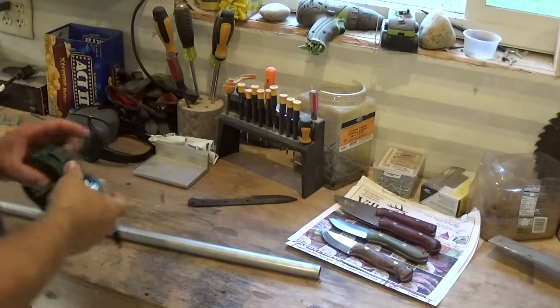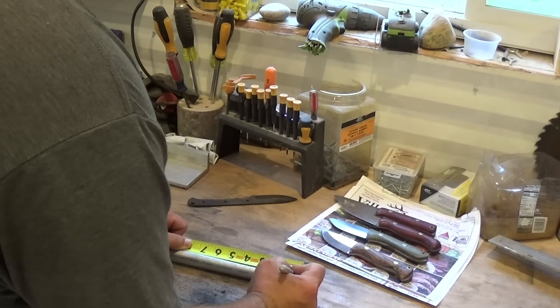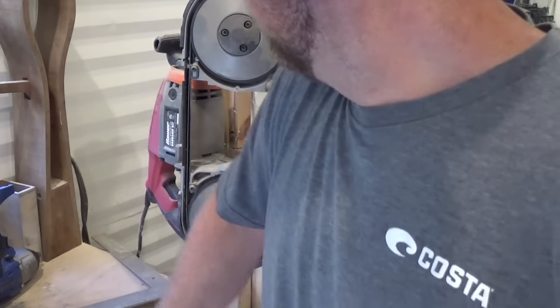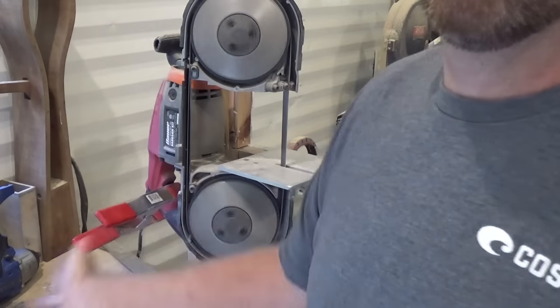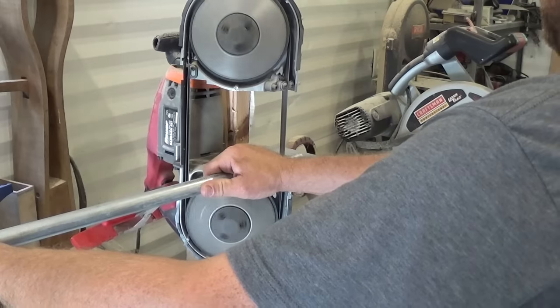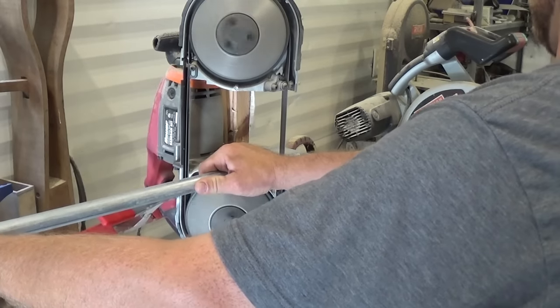For a heat shield to work, it has to have about a 1-inch air gap. And to get that air gap, I'm using EMT, and I'm cutting it down to 1-inch spacers. The screws will go through the spacers, holding the spacers up and holding the heat shield to the wall.